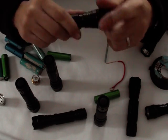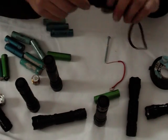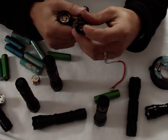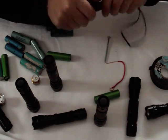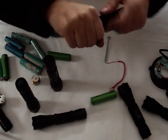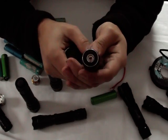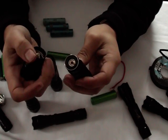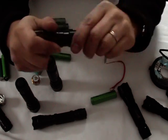If you've gone through those basic tests and you can't get your torch working, particularly if you've got one of the older ones, one little technique I find quite useful is — if you don't get a good contact — to insert a piece of wire. I've got an example of that on one of my XPG lights here. Just unscrew that. What I do is insert just a folded-over piece of wire inside that little spacer, and it just improves the contact between the spring and the battery cell inside. Just be careful when you tighten it up.